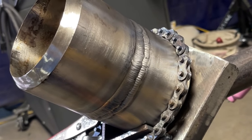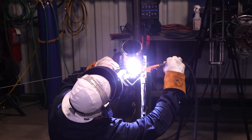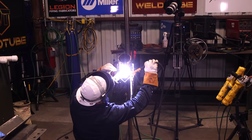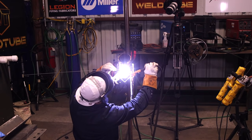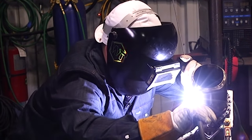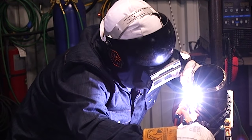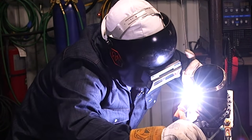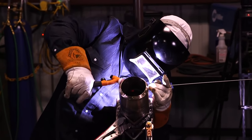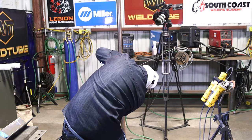It's really hard to see exactly where you're moving, but try to kind of look ahead and watch where you're headed. I turned my machine down to 55 amps to continue filling with the next two passes — we should be able to flush this pipe out. Again, be mindful of the high side of the bevel, try not to undercut, and try not to put too much material at once — it will sag. After the coupon is flush, I am going to turn the purge off; we should not get the coupon hot enough to damage the inside after that.